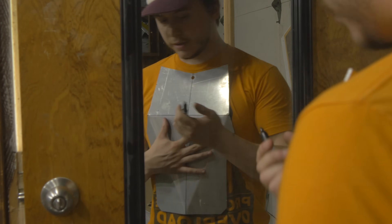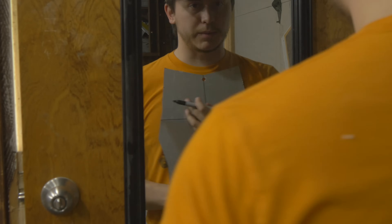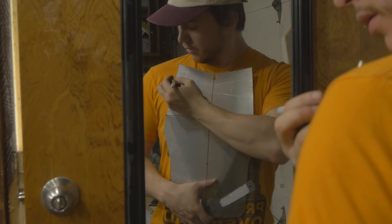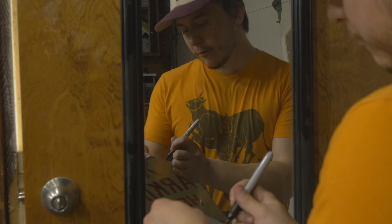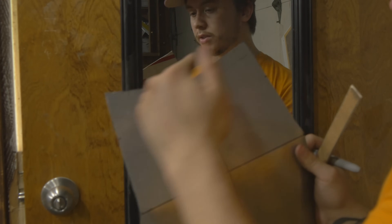In case you guys are ever wondering where I'm getting these weird, seemingly random measurements from — honestly, this is what I'm doing the whole entire time I'm building. I'm just bringing it over to the mirror. I'll put the armor piece up to my body and turn a little side to side, and I'll see, oh look, there's a big gap right there. That would look a lot better if I made a fold right here and curled it in a little bit. So I'll make a mark at the end of where that fold would be, measure how far it is from that top corner — in this case it's two and a quarter inches — and mark two and a quarter inches on the other side too. Now I've got two symmetrical markings and I can bring this over to the vise and just make these folds. It's really, really simple stuff.